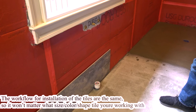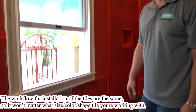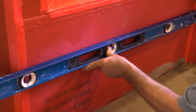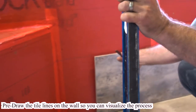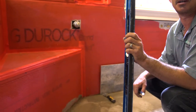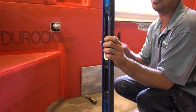The concept behind laying tile and installation is pretty much the same — the same principles apply to any tile that you install. The size really doesn't matter. What I did on this is this is the first run, and I made sure that it's level from the line all the way across. The first row should be leveled, and then once you have it leveled, you can keep going and you won't have to use the level.